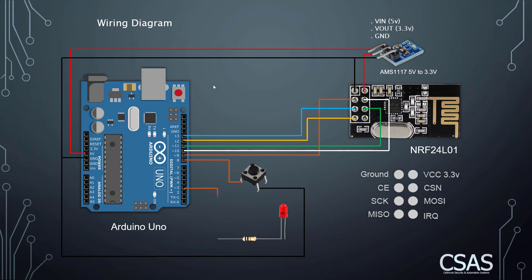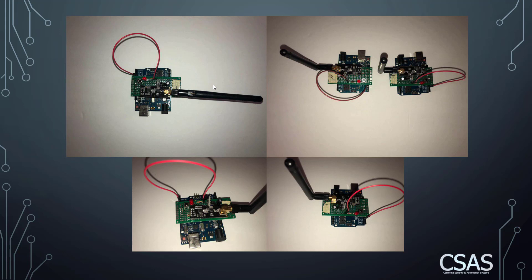We'll connect the LED to a 10K resistor, and from the resistor connect it to pin number 3. You can use any pin, but I'll explain why pin 3 in a moment. There's a lot of wiring here, so instead of using a breadboard I designed a little shield for both Arduinos. On this picture you can see 'R' for receiver and 'T' for transmitter. Pin 3 is the closest available pin because the shield covers all the other pins, and that wire is for the LED.